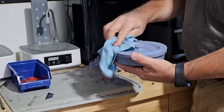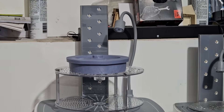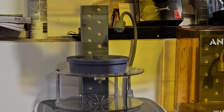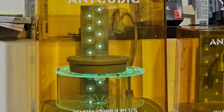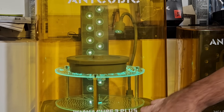Then after brushing off any impurities or chunks from the previous wash, I stick it over on the curing station. If you're not familiar with resin 3D printing, the parts need to be cured under a UV light in order to set the resin — otherwise it's a little bit too soft. So into the curing station for 30 minutes.